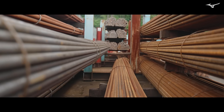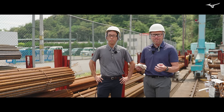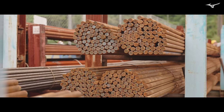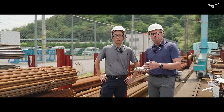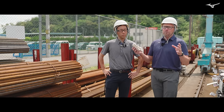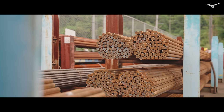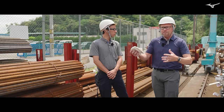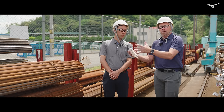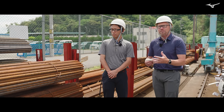The 241 uses the material that we've been using the longest, which is our 1025E mild carbon steel. It is an elite version of that material, and we call it elite because of the very tight tolerances we have in terms of what goes into making a mild carbon steel. So we can have a very consistent material, whether it's from set to set or head to head within a set — all very consistent because of that elite status.